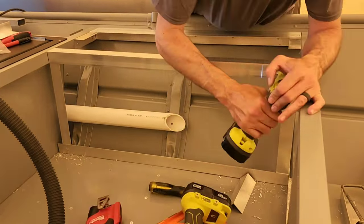Remember those panels I made for the front hatch? It was time to pop those back out and cut in access panels to the wire tubes. I cut these identical on both sides. The covers screw into place and when removed, allow maintenance access to the 2-inch wire tube exits that run the length of the boat. Note that I put these toward the front of the panel, so when the batteries are mounted, you still have access to them. Later on, I will vinyl wrap the covers themselves.